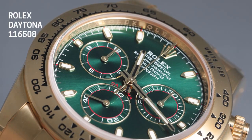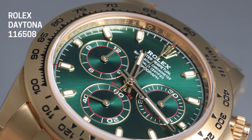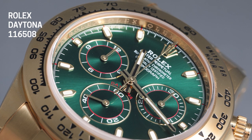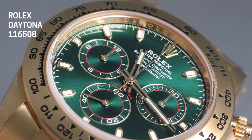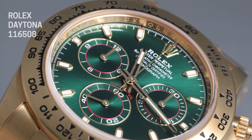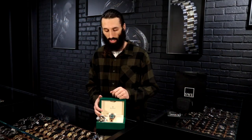Now, Rolex actually went so far as to create their own 18 karat formula where they take pure 24 karat gold and they melt it down and then add additional alloys, bringing it down to 18 karat, which would be 75% purity, to give it additional structure and stability and durability to help the watch last longer.